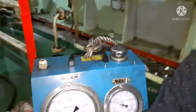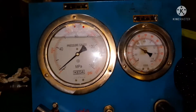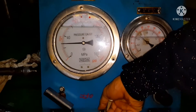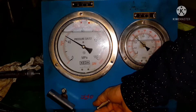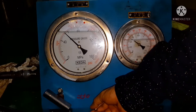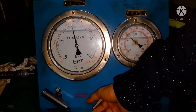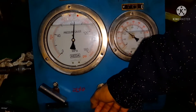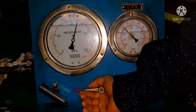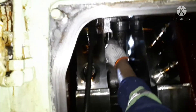Operate the pump so you can see the pressure increasing. As I said earlier, we need to reach 860 bar. For the opening pressure always refer to the manual — for this engine it is 860 bar, but for every engine it differs. Don't follow the opening pressure from this video; follow the maker's advice.